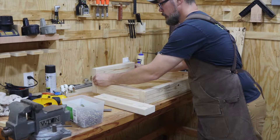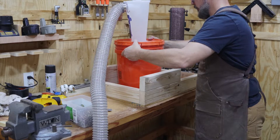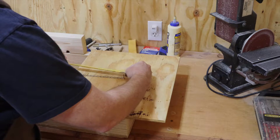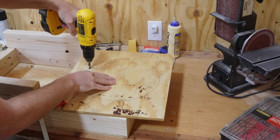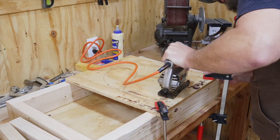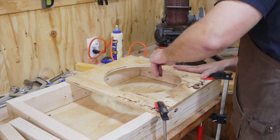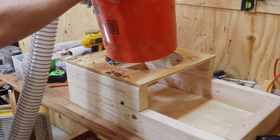I'm mocking up the top tier where the collection bucket is going to sit. I'm building up some height around the bucket so it's nice and secure and doesn't tip over once the hose is under vacuum. I'll cut a circle out of this plywood to hold it firmly in place. I have this spare bit of chain for marking out circles — just find the center, measure the radius, and draw it out with a pencil. Then I can drill a starter hole and cut out the circle with my jigsaw, go in and smooth the rough edges with 150 grit sandpaper, and do a quick test fit to make sure everything fits the way I expect. And it does.